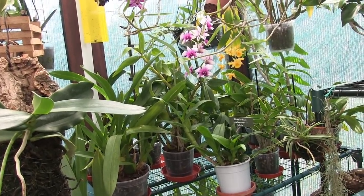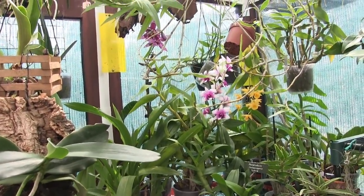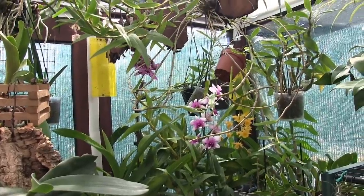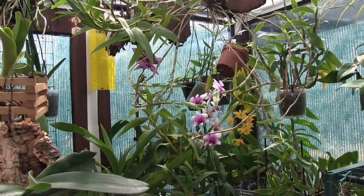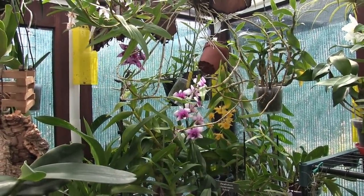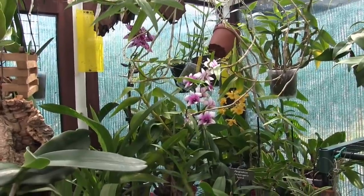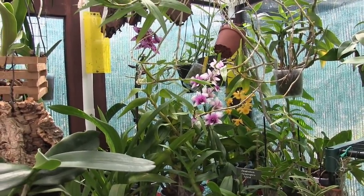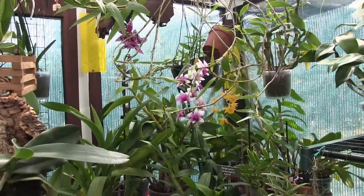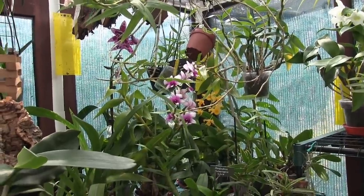Hang on, let's get this the right way round. Come on, brain. I know you haven't had enough coffee. If you had 100% humidity at 20 degrees C and your temperature rose to 31 degrees C, that same amount of moisture would read 50%. And that sounds like a hell of a drop. But the moisture level hasn't actually changed. It's just the molecules of air are whizzing around a bit more and farther apart, so the unit that you would be using to read it would just read lower.